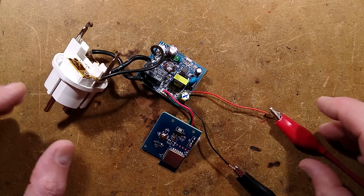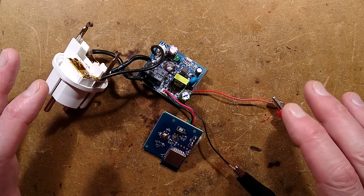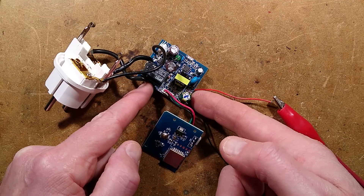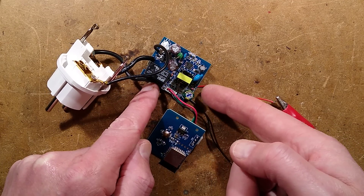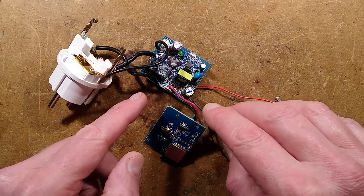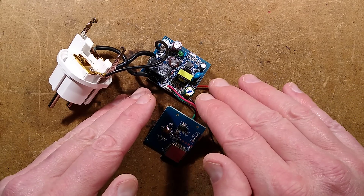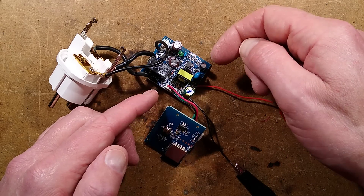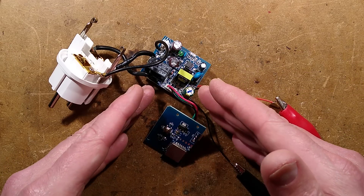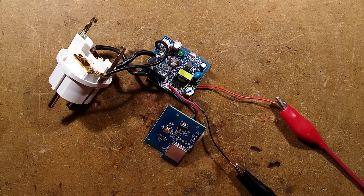I've now got this powered from my bench supply at just below 5 volts, so it doesn't cause too much current to go through the feedback circuitry. There is a bit of feedback circuitry — if it's a zener diode and opto-isolator, if you set the voltage too high on the secondary it can actually try driving that, because it's not switching off the current through the transformer. It can actually damage the feedback circuitry.